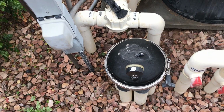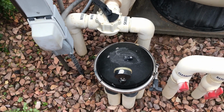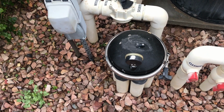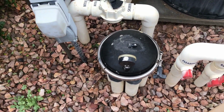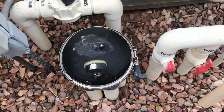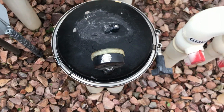It's just going to stay open on the steps, and that way I also have return flow in case something happens. But other pop-ups aren't going to pop up and then get in the way of the vacuum. If you have a vacuum that stays in the pool, it can hinder the movement of the vacuum. I've seen vacuums get hung up on it. So that's the second way that I've done it. So now it's just stopped on that zone, and you can stop it at whatever zone you want, okay?